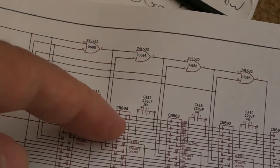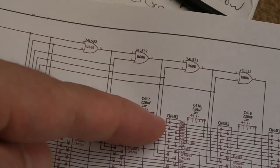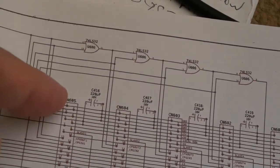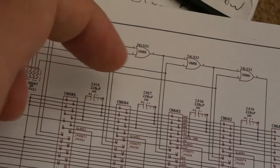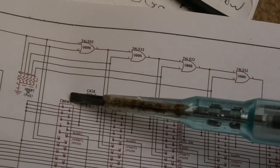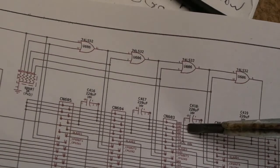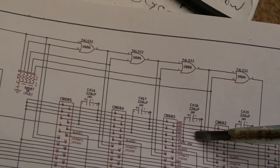It then looks at the next card, and that's a 4 meg one, and that's okay. And then it looks at the next card, you've got another 4 meg one, and that card there can't possibly be mapped in. It's used the 8 meg already in the first two slots, so it tells this card to shut up. Now, if you have a scenario where one of your cards is going to cause you a problem because it can't quite accommodate, let's say you had 4, 2, and 4 here, you're going to get your 4 meg. Then it's going to the next one, you've got 2 meg, it's going to allow that, that's 6 in total. Comes to this one, it goes, oh, you've got 4 meg, can't possibly fit 4 meg in, so it's told to shut up.